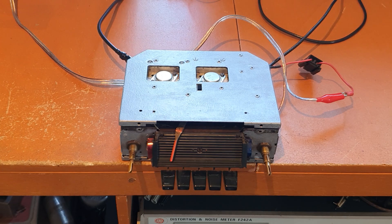Now the audio amplifier was going, but the RF section was dead as a doornail. One of the first things needed was to get the IF amplifier going, because that wasn't running at all. The main reason was that the circuit board in that area was cracked — probably caused by the radio lid being closed with something in the way, pushing down and cracking the board. Some traces were open circuit completely, some intermittent. It required a lot of bridging, soldering, and gluing the board back together to make it stable. That got the IF amplifier going.